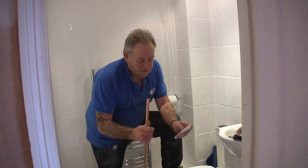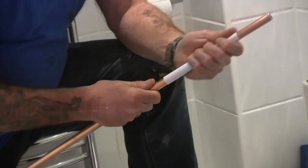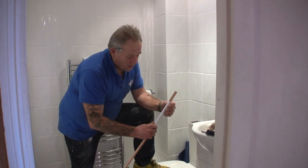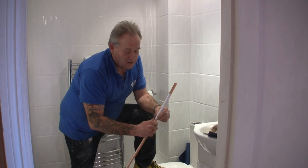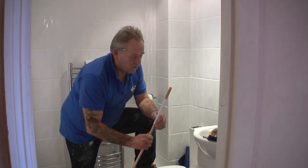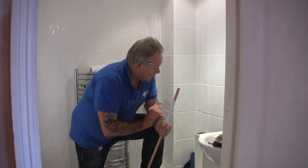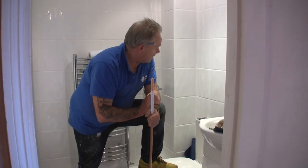The pipe snap clips over the copper pipe and covers it. You'll see them used on central heating pipes quite a lot. There are two advantages. One, it matches the pipe with the skirting boards or whatever you're putting it next to. And the second thing is that it warms the copper ever so slightly, so you're less likely to get condensation on a pipe covered in pipe snap than on a straightforward copper pipe — just a slightly warmer feel to it. So there are ways of reducing condensation on your pipes going to the cistern, and that's the way to reduce condensation on the cistern itself. I hope that's helped you in your bathroom at home, and it comes with our blessing from DIY Doctor.